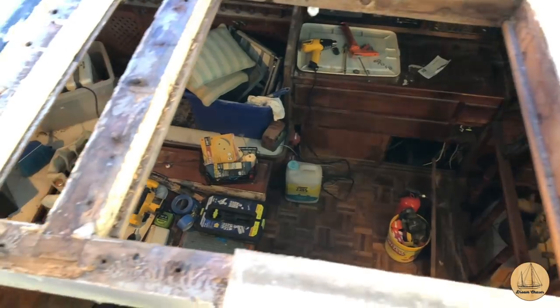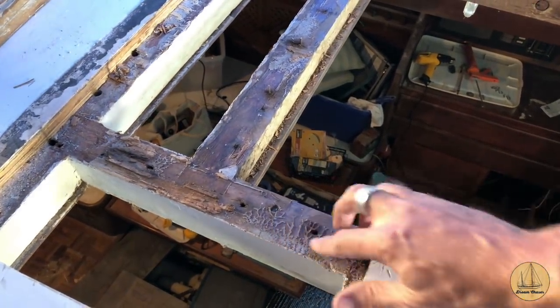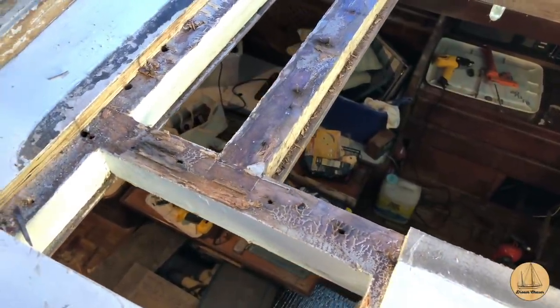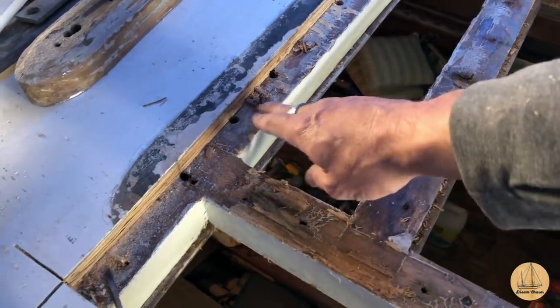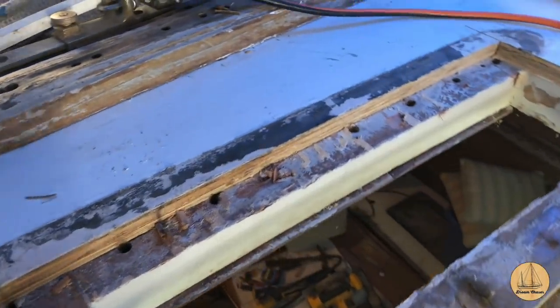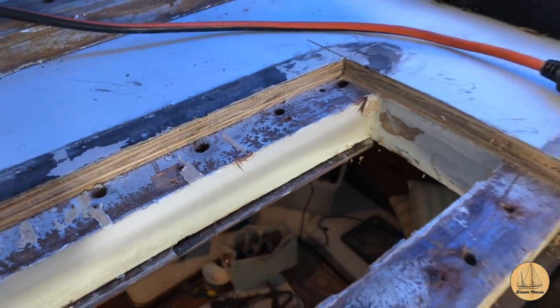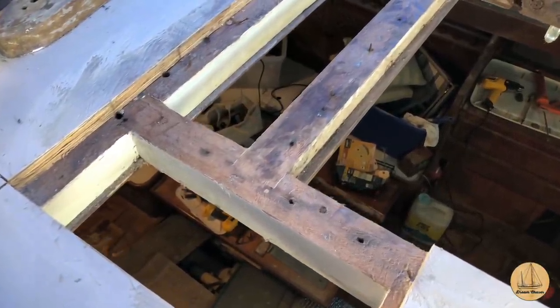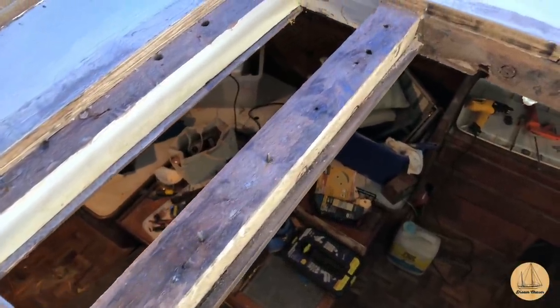It's Monday after work and I came back by the yard just to do a little more cleanup on where I removed the core yesterday - got a lot done but ran out of daylight. I'm going to get this next section cleaned up and show you what it looks like around this forward hatch. Here's the hatch - right along these beams you can see that gray material which is whatever adhesive or epoxy or polyester resin was used to hold the old core down to the frame structure. I still have a few pieces of core where it was attached, a couple of old nails to remove. The core that's existing along this edge right here is really good - I've gotten rid of all the sections with termite damage or rot.